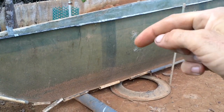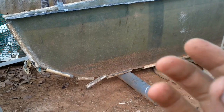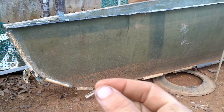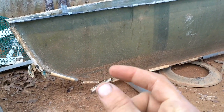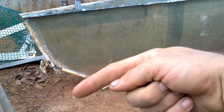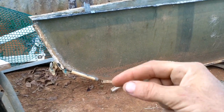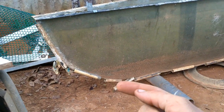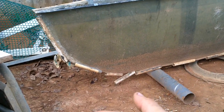There's going to be a motor at the top and a bearing. And down at this end, I need some kind of bearing too. The way I think would be the best way to make the bearing is to have the tube actually come through the hull and stick out partway, anyway. Then I could make a plastic bearing in there. And since the tube will stick out past, I can have some inlet holes for water that'll run through the plastic bearing so it won't overheat, so it'll have water going through it.